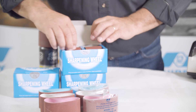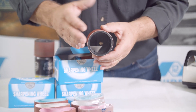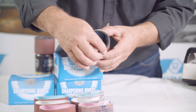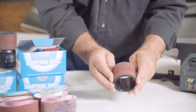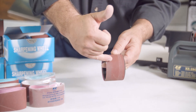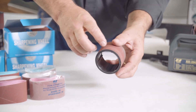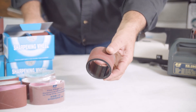You don't need to change the rubber wheel every time you change the belt. But probably after every 10 or 15 belt replacements, I'll start changing the wheels because the rubber starts losing its elasticity. Once you've sharpened about 50 knives, it uses the front edge of the belt. Get both wheels, turn them around, and you get another 50 knife sharpens out of the back end — so you should be getting about 100 knife sharpens out of a pair of belts.